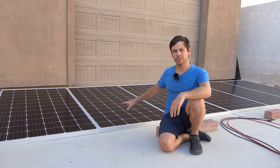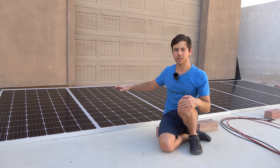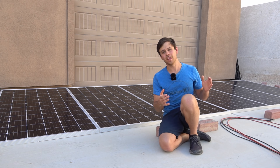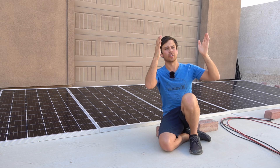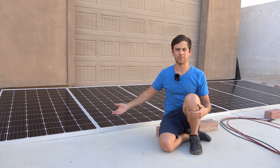These panels are tilted just enough to produce a lot of power during summer. If I want to tilt this whole array during winter I can easily do so by adding a few dollars worth of bricks. Personally I don't like tilting my panels that much, because most of the power you can extract from the sun is when the sun is directly overhead. It does help to tilt during the winter but for the other nine months out of the year you're better off just leaving them like this.